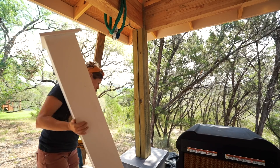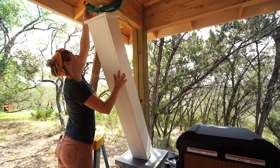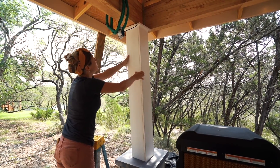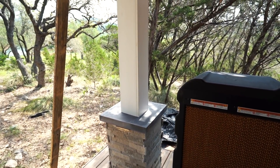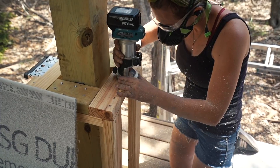So that's one way for wiring around the top and one option for moving the wiring down. But another way is if you have any posts in your structure. I have four, and while the bottom of mine will have stone on them, the top will be trimmed around. Again, this is where thinking of wiring in the design stage is helpful. Before I added cement board and stone to the post, I made a few modifications to later run lights and wires.